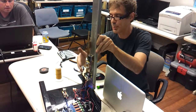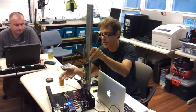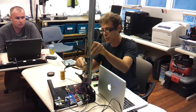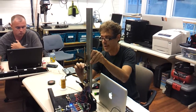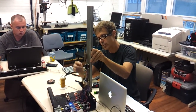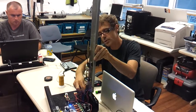by design, the people who make the brass make the round stuff fit in the square stuff precisely. It's why they sell the stuff. It's why you pay money for it, is because there's all these different fits that happen between these different sizes of material. So there's a round piece that's soldered inside the square one, and the round piece is actually the bearing surface that goes through. And on this one it's soldered. It's actually soldered to the vertical shaft.